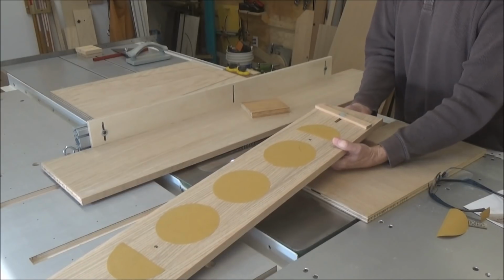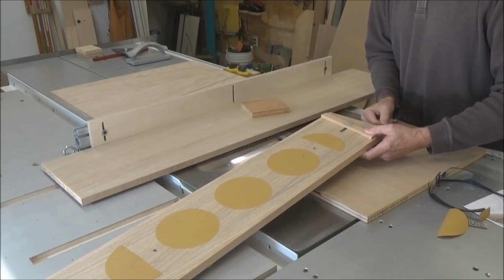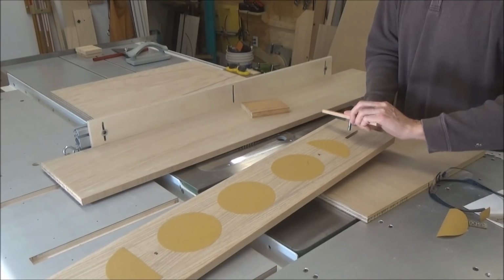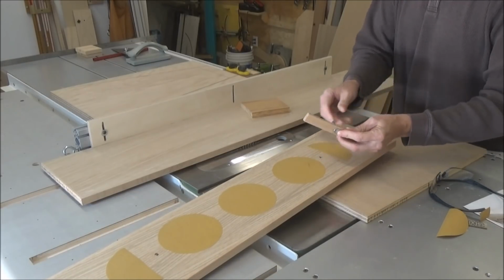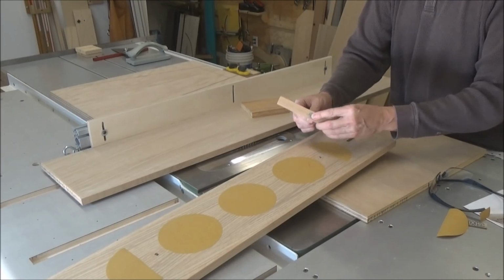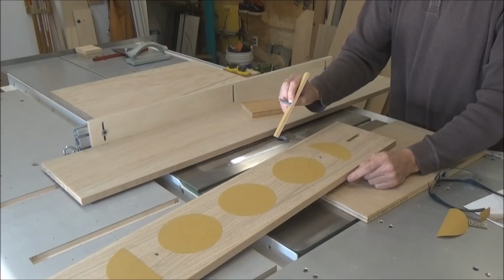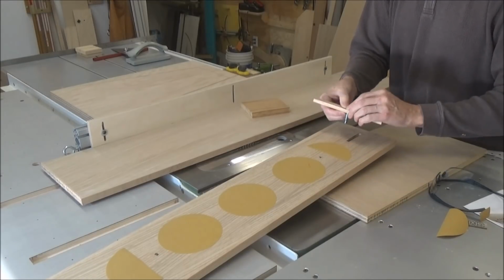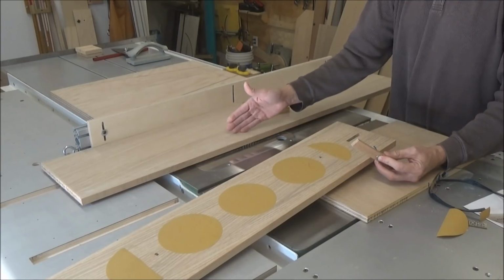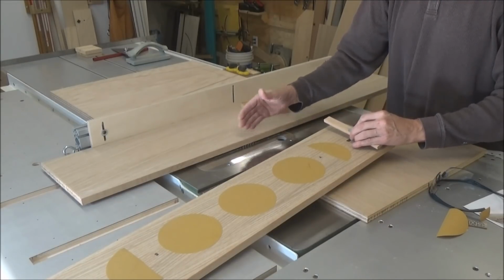That's got some sandpaper. Let me take it off here quick for you. So it's got sandpaper on that side so that when I clamp it, it doesn't move. And it's nothing more than a 5/16 toilet bolt countersunk into the base of it. It's about maybe 3/8 of an inch thick. That can be thinner if you wanted, or thicker. I'm generally using this for 3/4 inch stock, so it needs to be thinner than the thickest piece that you're going to run through here.